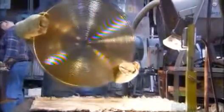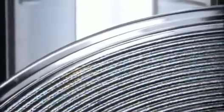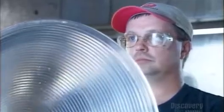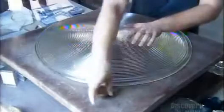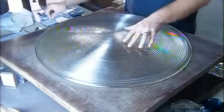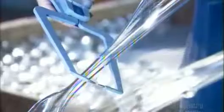Using heat-resistant mitts, workers scrutinize the glass from every angle, checking for small fractures or imperfections in the glass. Next, they inspect for flatness, using a paper-thin plastic feeler. If it slides underneath, the lens is warped and unacceptable. They check the glass thickness in many locations using a calibrated thickness gauge. Any major defects, and they discard the lens.